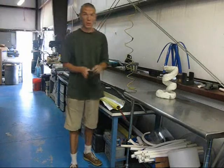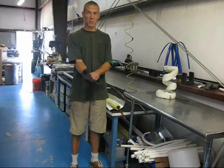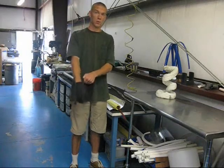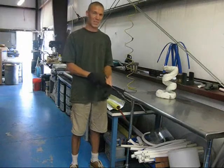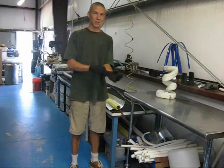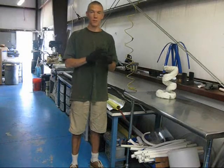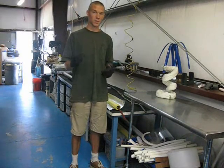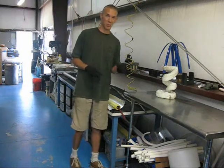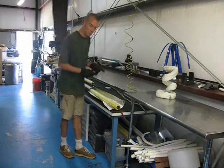Be sure to put your gloves on before you take the pipe out of the bender — the thing is hot. PVC softens at about 220 degrees, which is hot enough to burn you. You don't really need thick gloves because it's not that hot, but you do want some protection for your skin. Even if you have calluses or you're used to high temperatures, you still really don't want this — this kind of burn sneaks up on you and the next thing you know two days later you have a blister.